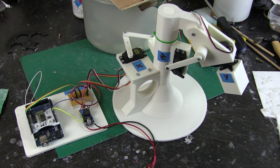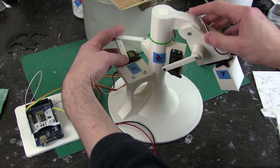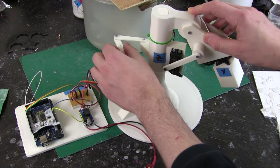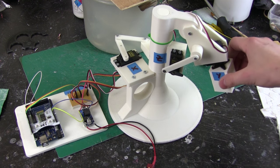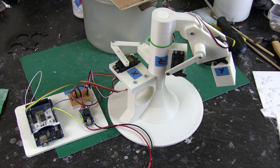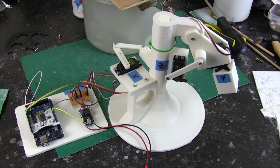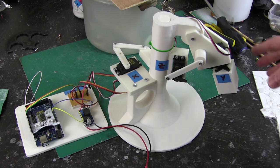If you've been watching the series since the start, you'll remember that in episode three I built a little test arm which I controlled from one of the motion capture sensors I'd built in the previous episodes. It's really worth having a look back at those early episodes, starting with one, to see why I'm taking this design approach. So I did something slightly unusual with the arm — instead of having a human-like shoulder, what we've got is a rotating element that rotates the shoulder, then attached to that the ability to lift outwards, and attached to that the ability to twist. This worked quite well to take the Euler angles straight out of the motion capture sensors and build this mechanical arm that inherently uses the same angles in the same fashion, rather than having to translate them.